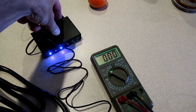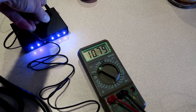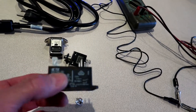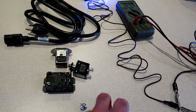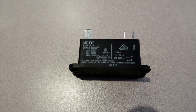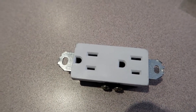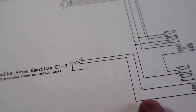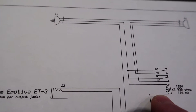The Emotiva is advertised as 12-volt output at 150 milliamps, but you can see I only get 10.7 to 10.8 volts out of it. This 12-volt relay will activate down to 3 or 4 volts. To get a 120-volt relay that is 12-volt actuated, they take a lot of current — there's no real standard for current on these 12-volt triggers. So this 12-volt relay will work on about 20–30 milliamps, triggering anything without burning it out. The 120-volt relay has a 120-volt coil, and there's a 15-amp circuit breaker. When wired up, 12 volts from the Emotiva ET3 keys the 12-volt relay, whose contacts then key the 120-volt relay coil and give you power through the box.